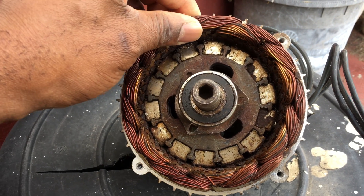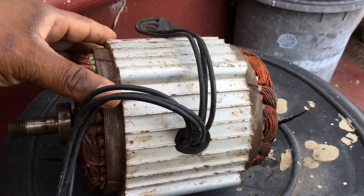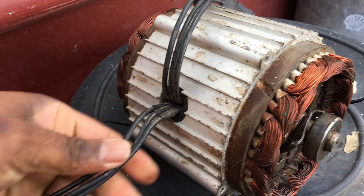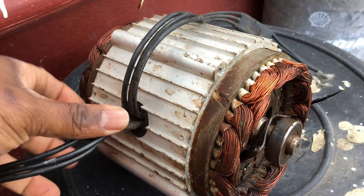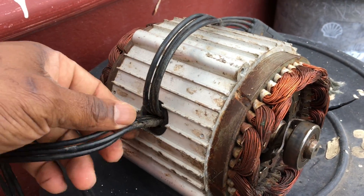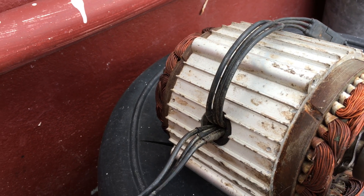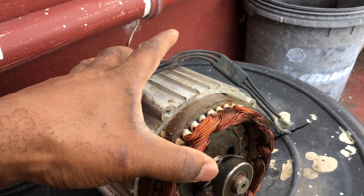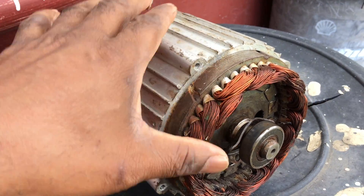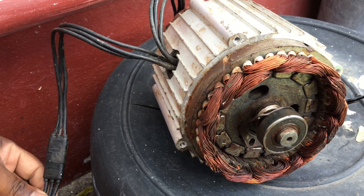There are two separate pieces inside here independently, and the conductors come out — one side for each. So in fact, one side could be faulty and not producing anything, and you'd still get some production out of it. It's three-phase — three-phase wild AC — so you have to use a rectifier, feeding these lines into a rectifier to tap out the DC voltage. They cannot be connected directly to anything other than a rectifier.